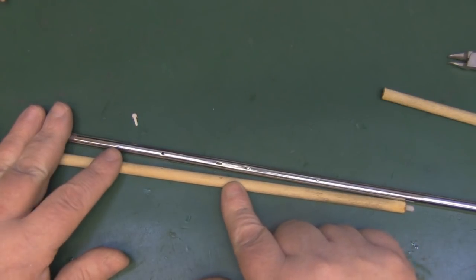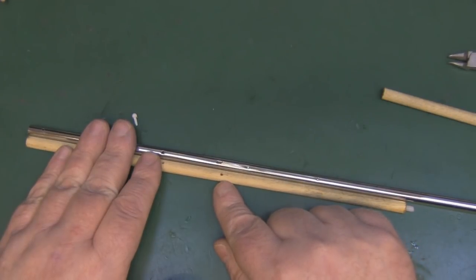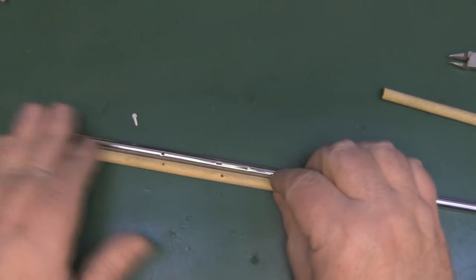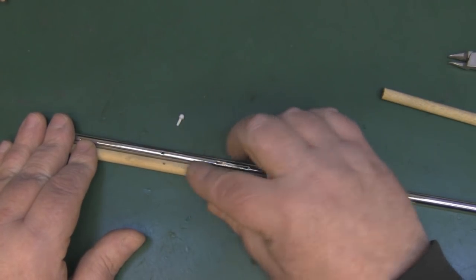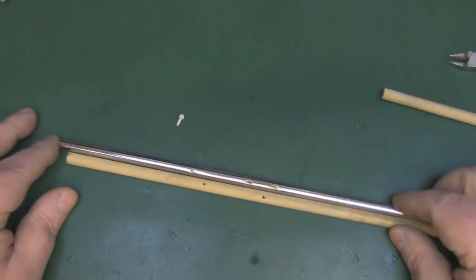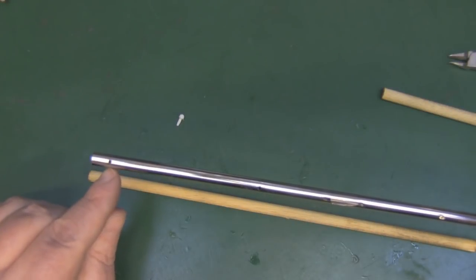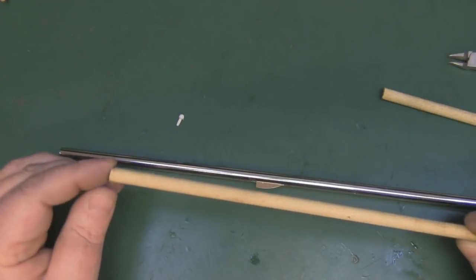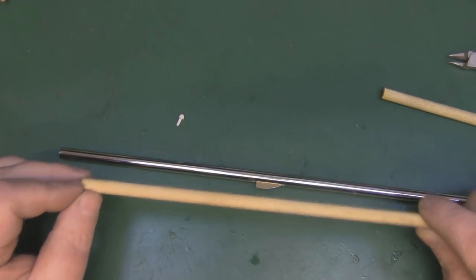I'm going to replace the catches on the wooden dowling using a split pin through the middle, or something plastic through the center. I've drilled the hole through there, and there's also a little plastic stopper I've removed and drilled a corresponding hole in my wooden dowling so I can glue it in place. The metal rod was held in by just a little pin onto the top part of the umbrella. Since my dowling fits pretty snugly, I'll just put a little bit of epoxy on the end and push it in - that should do a good job of holding it in place.